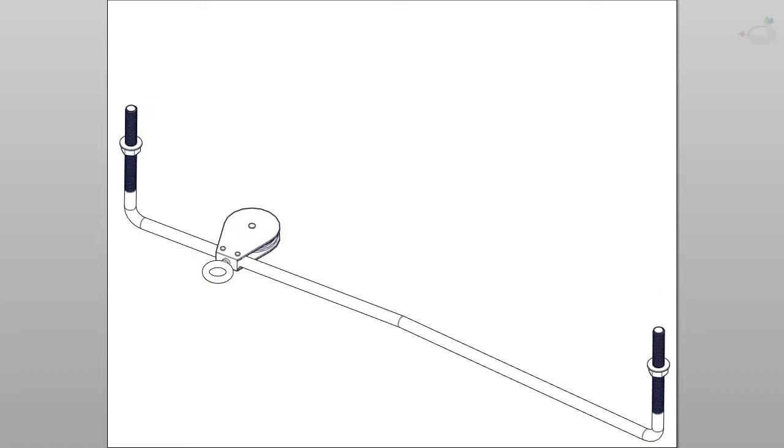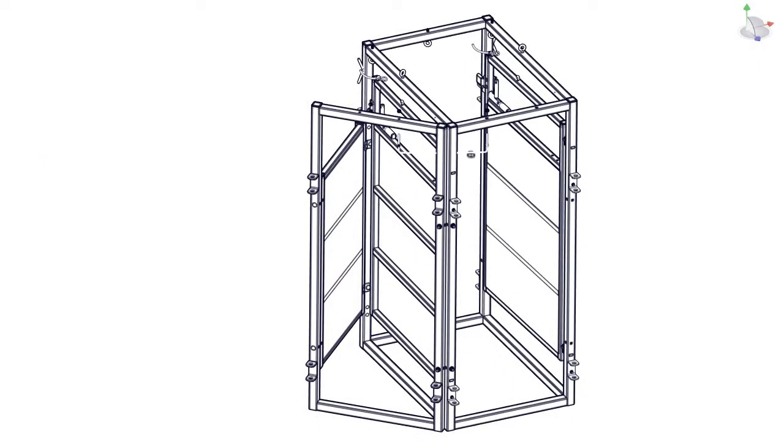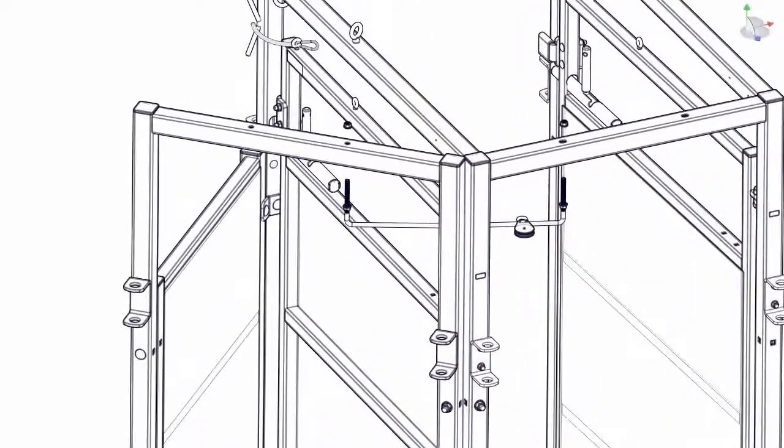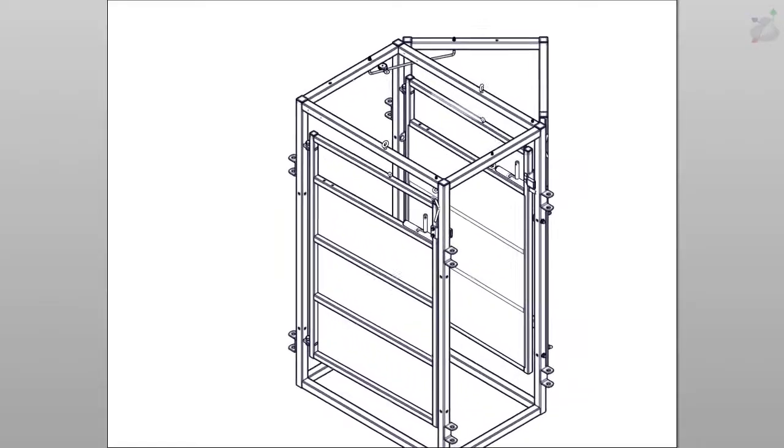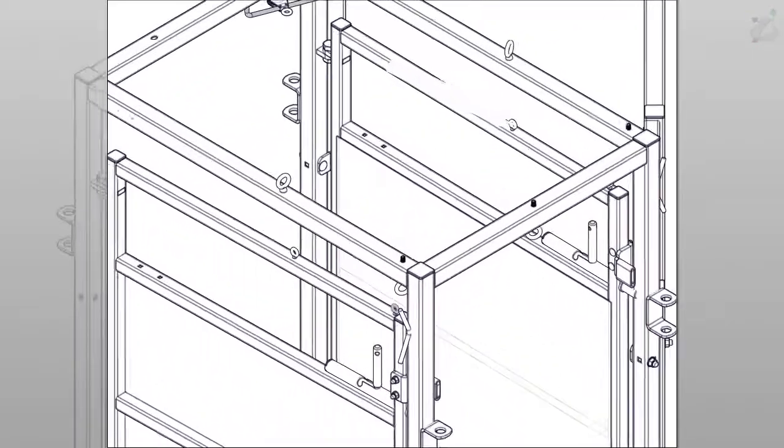Connect the sort bow to the 45-degree panel using 2 5" carriage bolts and flange nuts. Place the swivel pulley onto the pulley leader. Secure the pulley leader into the corner of the main frame and sort bow with 3/8" flange nuts. Install the 16" extension spring.